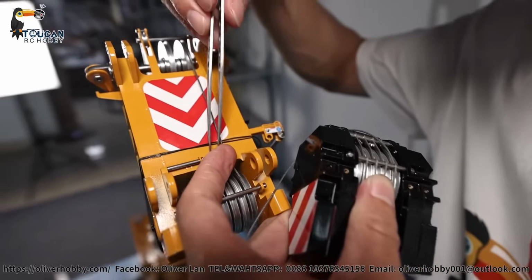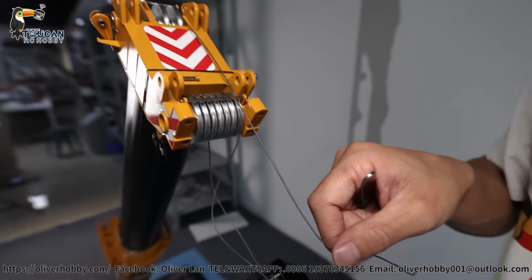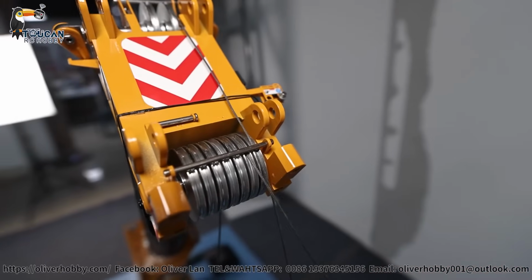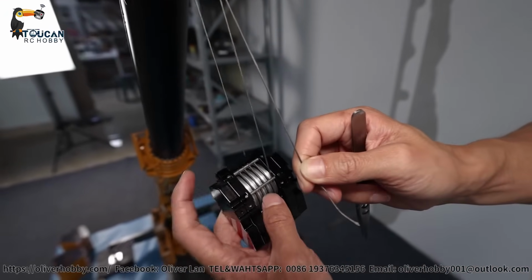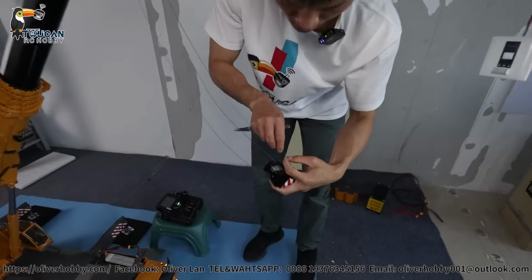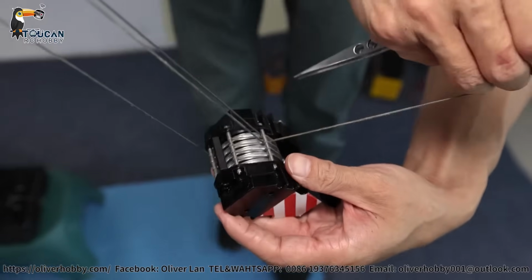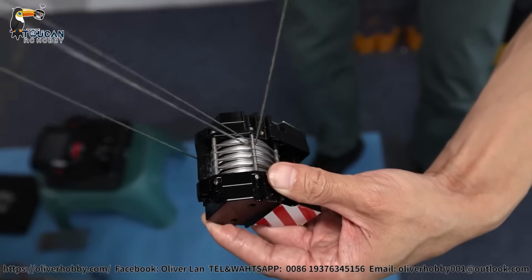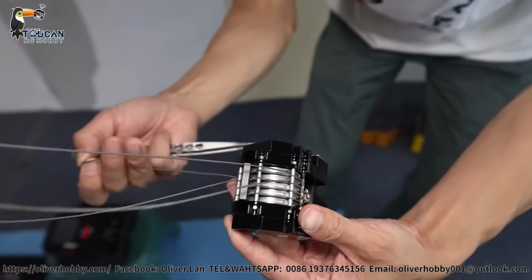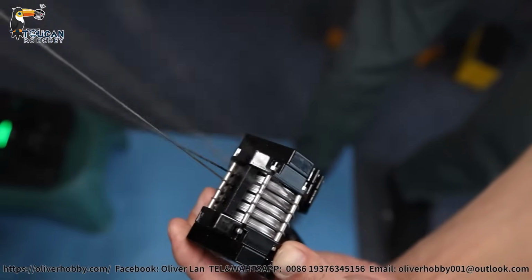Second one, take it out. Sorry, not aligned. Align with the second one. So that also needs to run through the pin. So one by one like this, running it. And now we drop it for more wires. Okay, continue running through it until all the rollers. Pulling a little bit, yeah, because if not pulling, the wires will be off the roller. Then we'll have to align it again. Pulling a little bit, it will not come out from the roller slot. Other side, take out one by one. And this pin running through it, one by one. Good, so the second one is done.